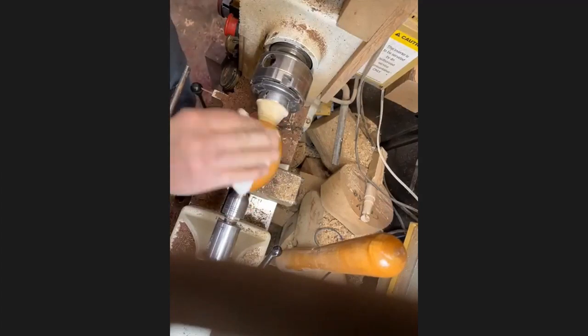But tonight, I'm going to spray a little accelerator on here so that we can completely finish it. I'm going to use a heptane-based accelerator. I don't use any acetone-based accelerators because people spray the hell out of it. They're spraying acetone on it, and they're dissolving the very super glue they're trying to make acrylic plastic out of. And they wonder why they get cloudy and shiny and all that other stuff.